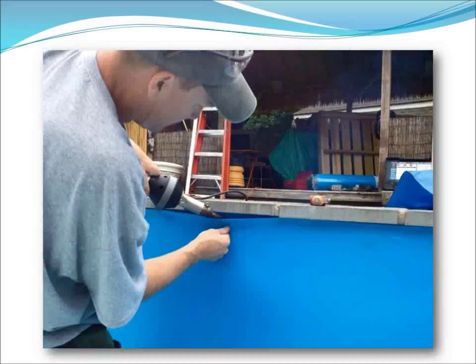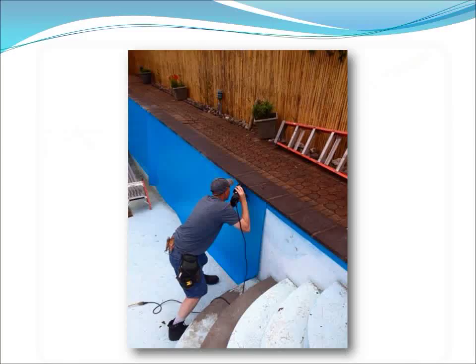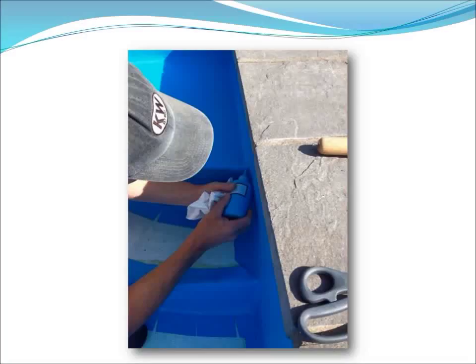Then we heat the Pool Hide directly to the metal strip and weld it in place. Eric, our chief Pool Hide installer, can be seen here performing this weld. When welding Pool Hide together, our welders use very hot air to melt the Pool Hide together during the welding process. The welding technique consists of two parts: first, we tack weld the two sheets together about one and a half inches in from the edge; then we perform a second weld directly along the edge of the joint. In a final step, we place a bead of liquid Pool Hide along the seam to blend it in for a better look.